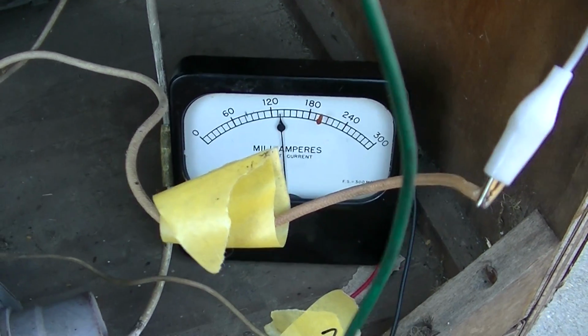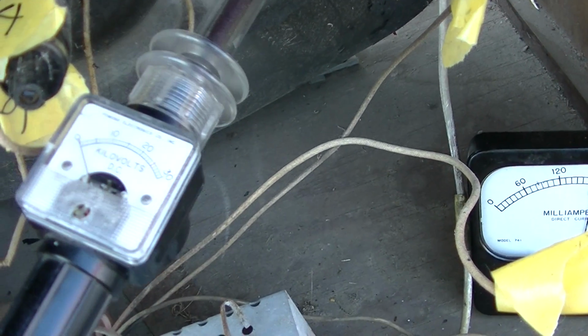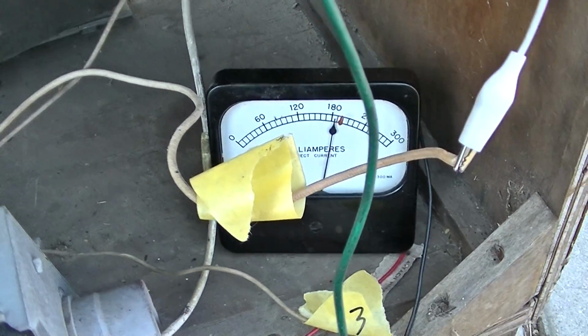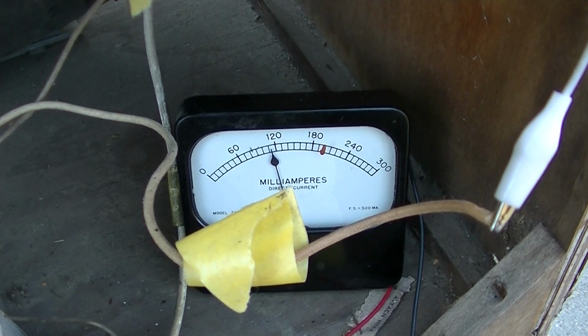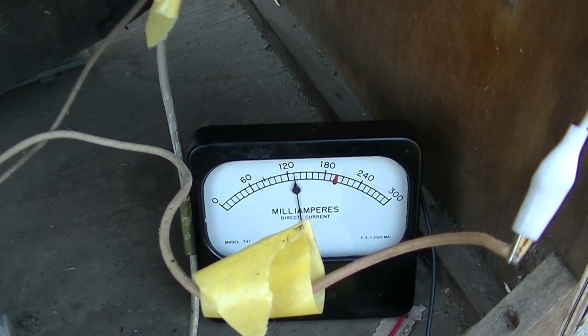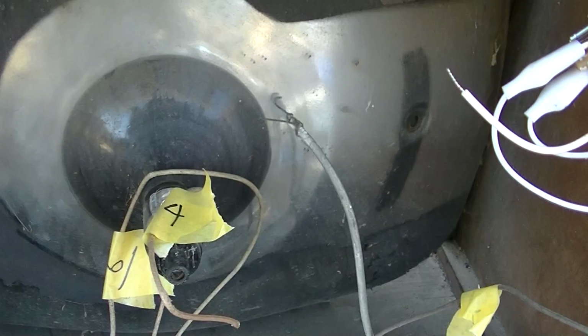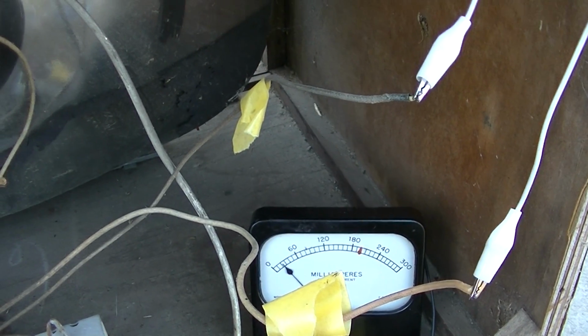So that definitely drove our plate current up. And still about the same. Wow, the plate current's way high. It's weird, I hear it creep up, then I hear something like an arc and it pegs. Almost sounds like the CRT arcs internally. Or maybe the high voltage rectifier is arcing. Now that it's developing high voltage because the yoke is in place, let's see what happens here.